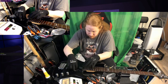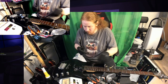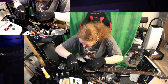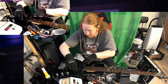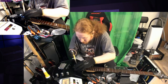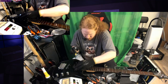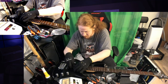Yeah, that's way, way better. I'm glad I decided to buy these. What you need to do in order to get a very fast, easy, and clean solder edge is that you do what's called a pre-tin, where you apply some kind of solder material onto the wire you're going to solder. That helps it with sticking to the surface. So you pre-tin both ends, and that just makes the whole process way, way easier.